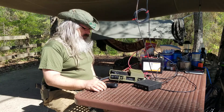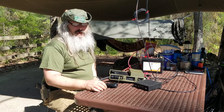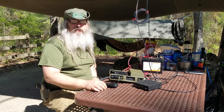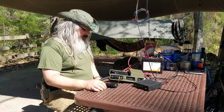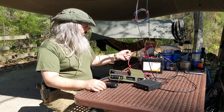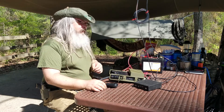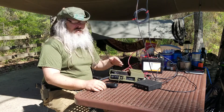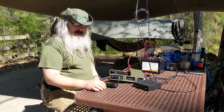The FT-857, when in special battery mode with the brown wire, will do 20 watts max on all frequencies except 70 centimeters, which it'll do a little bit less. Basically I can use this radio to operate QRP, or if I have a more powerful battery I can extend it. I can also un-jump the brown wire and in a pinch use the battery to do full power, though it would probably be bad for the battery. From the car battery I can go full power.